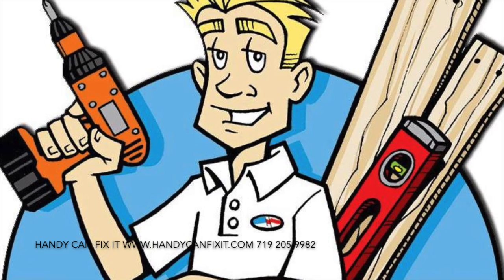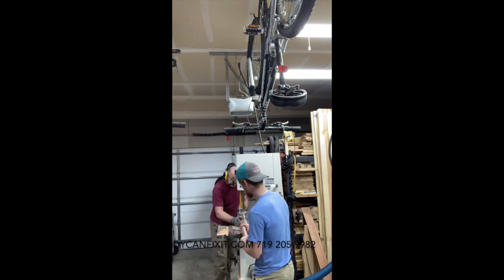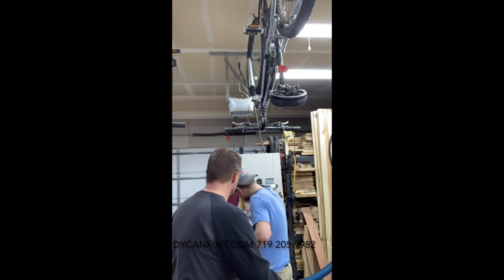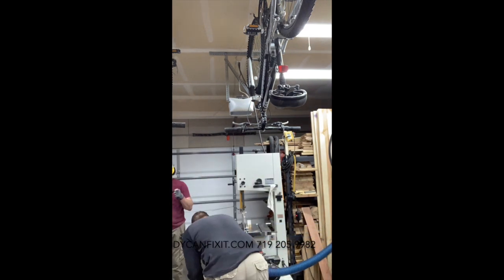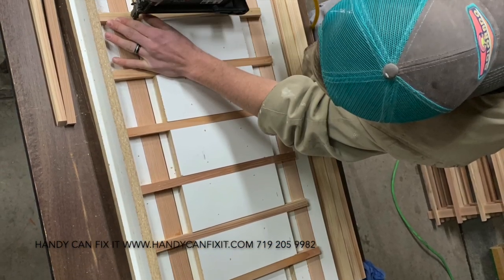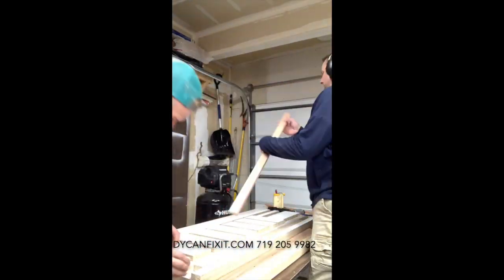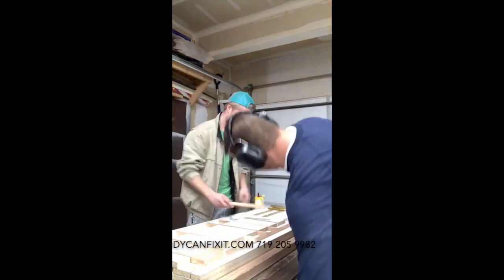Hey friends, Scott here again going to walk you through some of this process. We're very thankful for Paul and all the tools that he has over there in his garage where we could make all this stuff. We had to start by milling all the redwood for this table ourselves from 2x4 and 2x6 because it's very hard to find affordable redwood stock, especially redwood heart. Then we had to build jigs — those are the white parts that you see there — that hold all the rails and stiles together, and then we do a glue and nail together process to get all of those little things that look like ladders made to hold the wine.